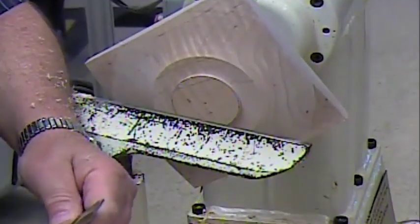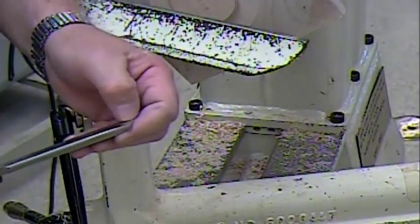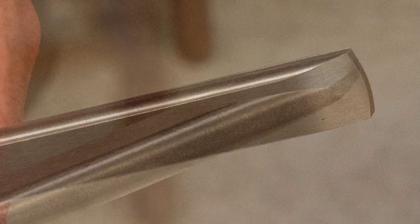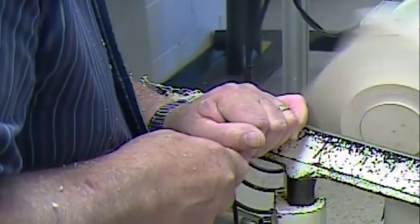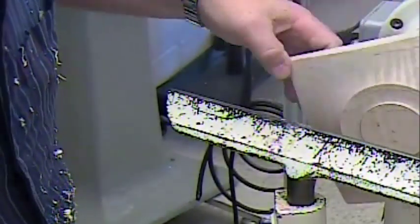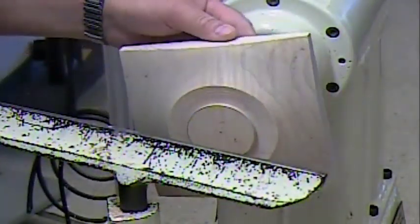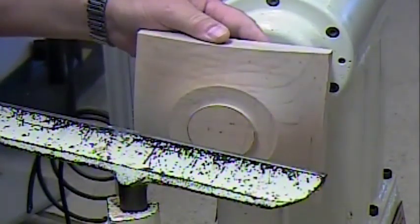The one that works best is another one of Eli's tools. It's ground convex and he's ground a flat at an angle across the edge so that you've got a radius. It's used the same way — you just tip it up on its edge. It makes nice light shavings and does a really nice job. There's virtually no tear out. There are some lines in there but the lines come out real quick — a little bit of chip out, but nothing serious.